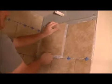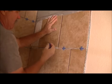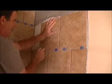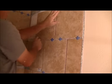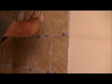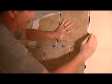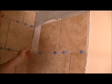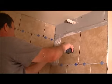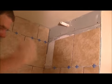Let's put this piece on. Here's what I usually do — I start high, and then it wants to come down, so I let it come down on my spacers. I actually push it in, and you can also feel it. Move this one this way a little bit. It should be the same as that one — and it is. Five and three quarters minus. Let's cut that piece, and then all we have left is to put the bullnose on and we'll be done.